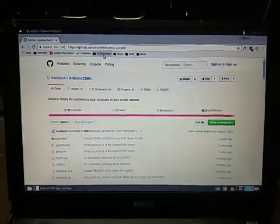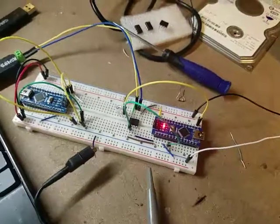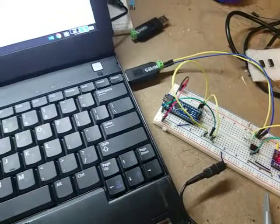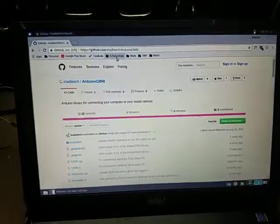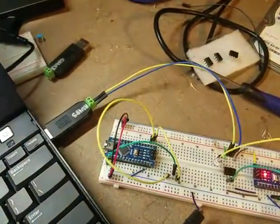The trick is that if you want to use more than one Arduino — say one for your turntable and one for your shop lights, which is my situation — you have to do some really fancy stuff. JMRI won't let you add another Arduino as a separate CMRI connection. You can't just connect them both via USB. You have to connect the Arduinos together and have one connection to JMRI, and the way you do that is with RS-485.